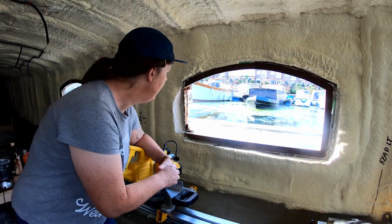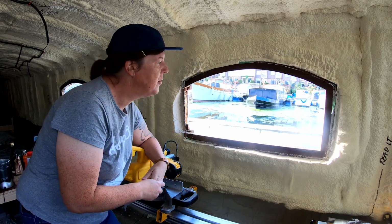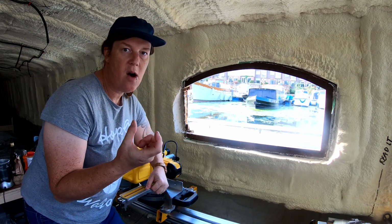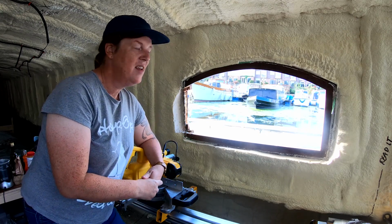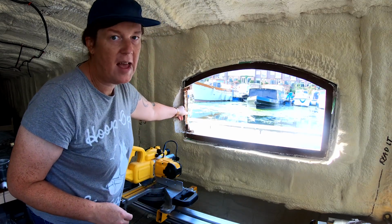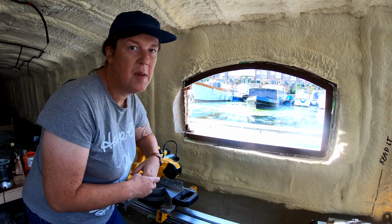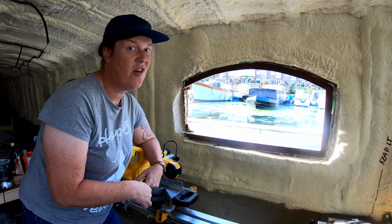So the plan is, these windows, these frames at least, I now know are fitted in with some screws, and there aren't many screws, and actually they are absolutely rotten as well, so there's obviously been a lot of water around here in the past, which isn't ideal. However, you'll be able to see this kind of edge flange, so the side of the coach roof comes along and then bends in. So I think this has always been an area of water ingress.